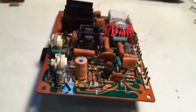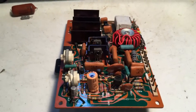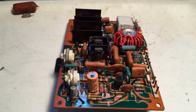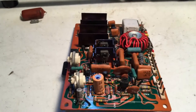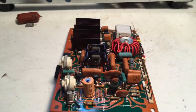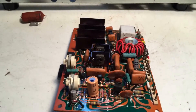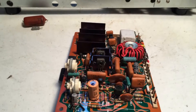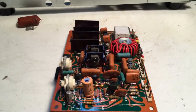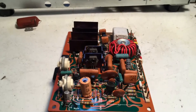I've got a left power amp board out of a Marantz 2275 and I'm just going to remove two or three components here and try to show you how this works. We're going to start by removing that orange electrolytic capacitor there, and then we'll remove a differential pair of transistors that has six leads total, and you can see how easily that comes out.